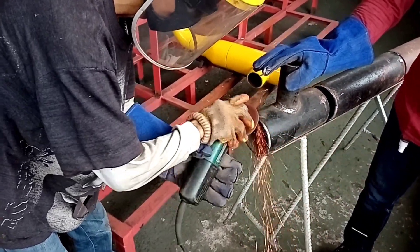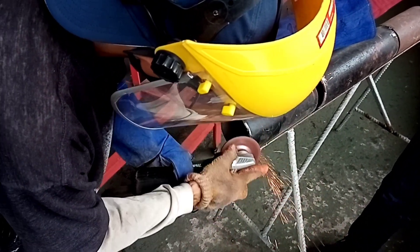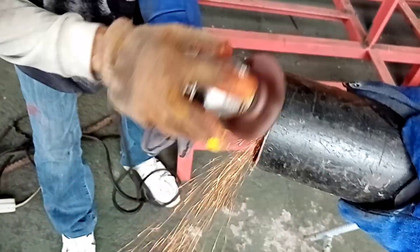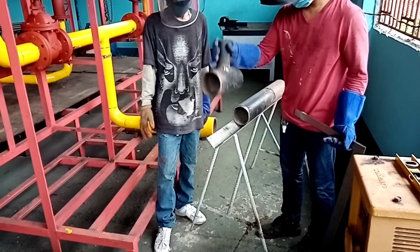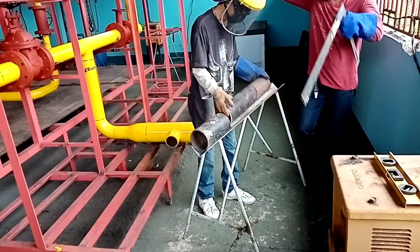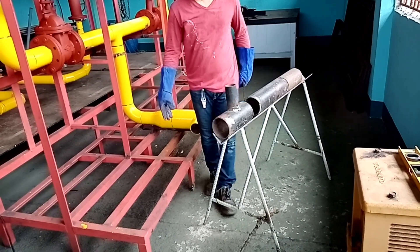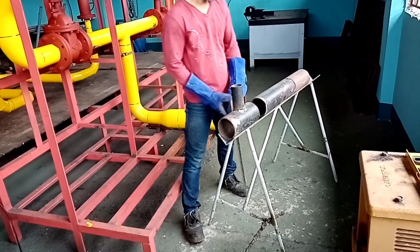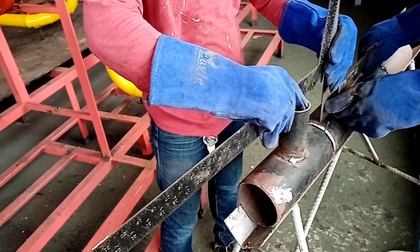This shows the position of fit-up from the reducer to the spool of pipeline. The procedure: a butt joint beveling, allowing for the welding gap, tack weld on top. Place the square on the top of the pipe, then place the second square in the center of the branch outlet. Move the T until the sides of the square are aligned. Place the third square at the top of the pipeline.